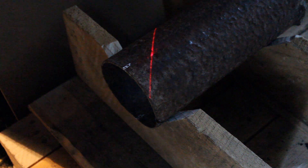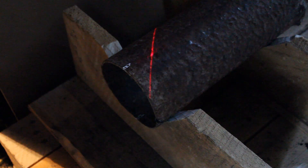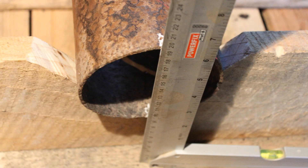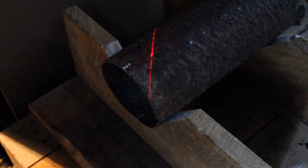I've turned the laser through 90 degrees so the 45-degree line is now in the opposite sense. I've repositioned and squared the pipe in exactly the same position with respect to the first cut, so it's vertically beneath the laser line on the other side. I've checked the squareness with a tri square on the two chalk lines, so hopefully when I go in with the angle grinder the cuts should start to coincide.